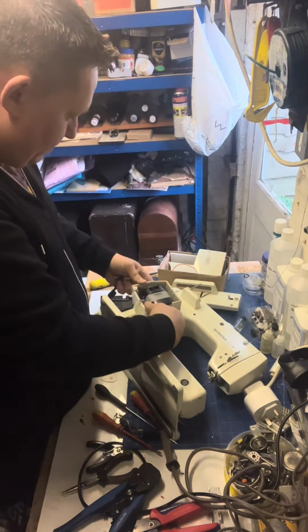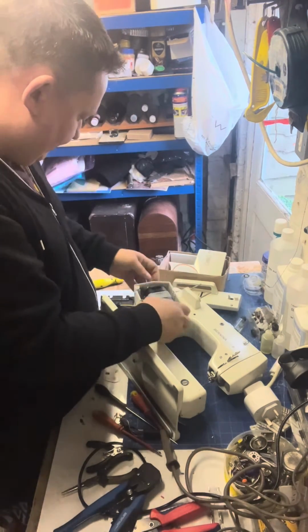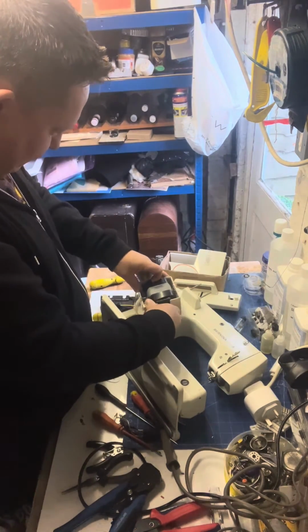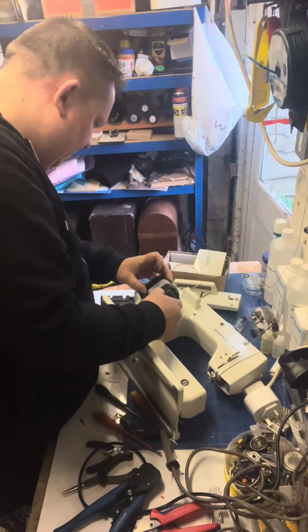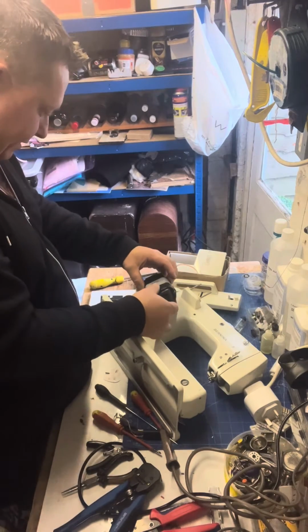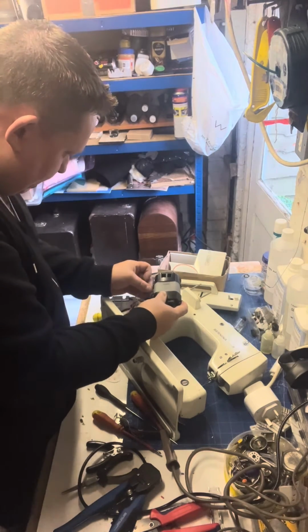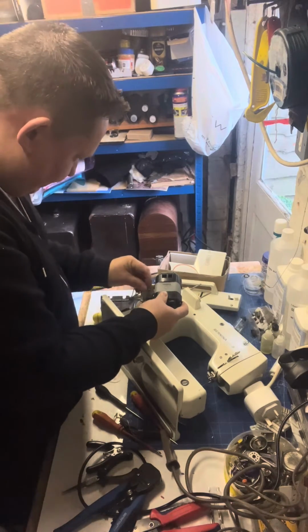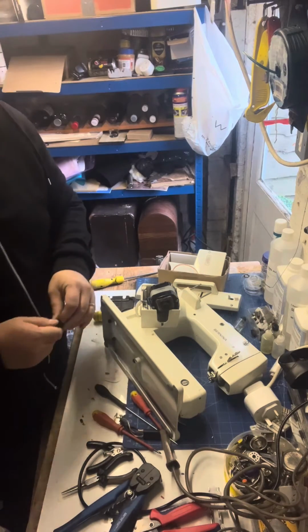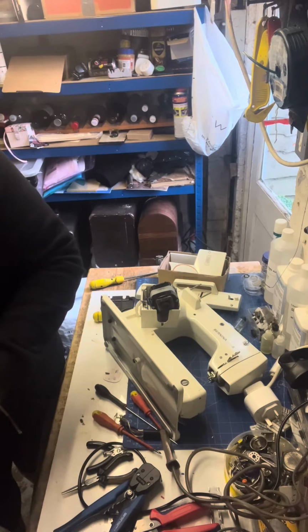So I'm just going to pop the motor out of its housing gently. The commutator looks good. And the motor brushes, I can see they've got at least 5mm visible, so plenty of life left in them. So just install the new capacitor. Oops. Let me check I've picked up the right one and not one of the older ones without the bleed resistor in it.